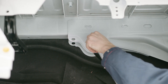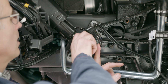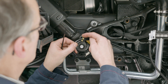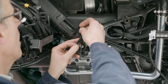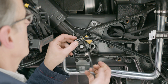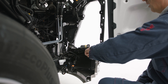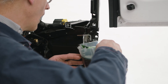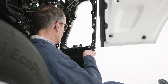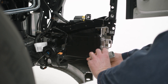Follow the recommendations of the truck manufacturer if and when torque needs to be applied on the cylinder mounting bolts. After replacing any part of the cab tilt system, the oil level in the system needs to be refilled. Only use the types of oil recommended by the truck manufacturer. Check the oil level in the hand pump reservoir and fill it up if necessary. The oil level can only be checked when the cabin is in driving position. It should be visible in the hole beneath the filler plug.